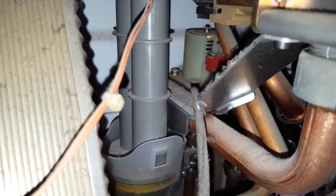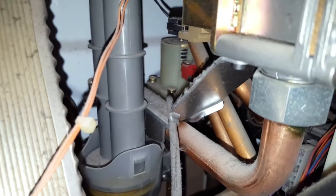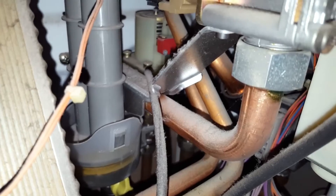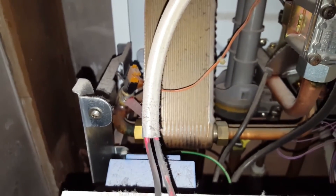What happens when you turn on the hot water tap is that spring will move and make contact with the red micro switch. That's the first thing that activates when you're on the hot tap. If that makes contact, then the sensor gets the calling signal and from there the PCB takes over.